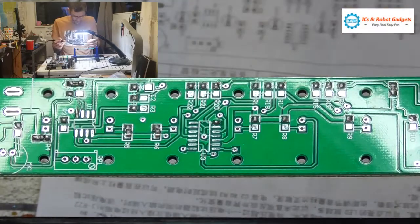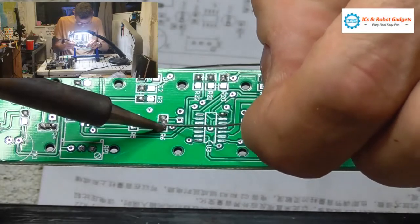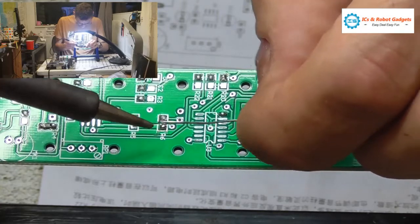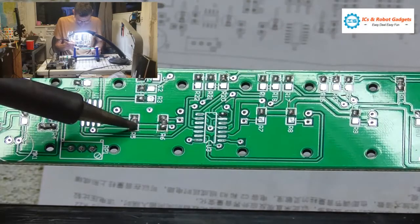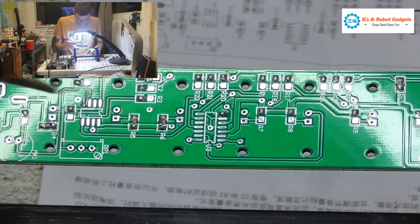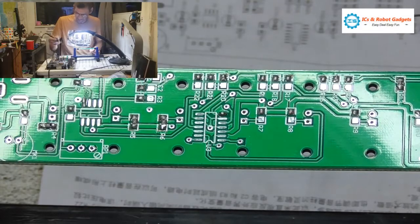Is it the type that has a ballast, or is it the filament glow? So we'll just do the other side of these two. Tube, or is it one that's the 400 watt with the ballast? Any that are based in phosphor will gradually degrade. But the ones that are based in phosphor are the most efficient. My favourite ultraviolet source, I suppose LEDs have replaced that now, but my favourite up to the LEDs, not sure which is the most efficient, is the 4 foot 36 watt fluorescent tube, the black light tube. They are the most efficient.